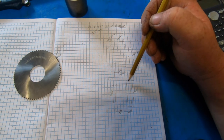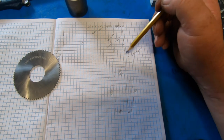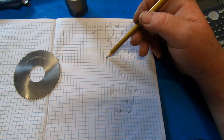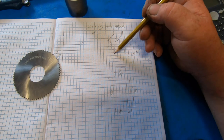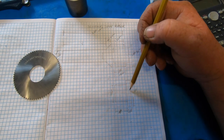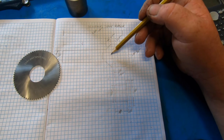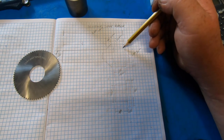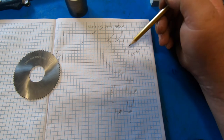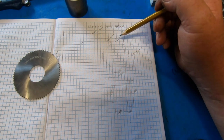And that'll have around 1/4 inch, a bit under, shoulder on it, that'll push against this edge of the arbor. I'm going to put a 10mm fine thread, 10x1, in here to hold this cap, just a clearance through hole and recess for the cap head bolt. So that'll be a 10x1 thread, and this piece here will be a very snug fit as a retainer. I'm not really good at explaining things, but I hope you get the gist.